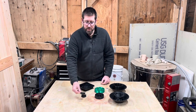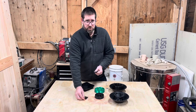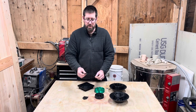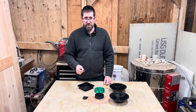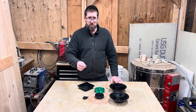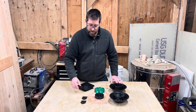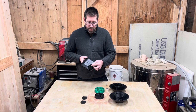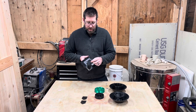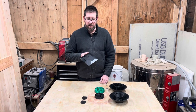So I moved on to the second iteration. I measured how short it was, added that to the overall length, changed the radius, and put a slightly bigger clip in. I printed it out and snapped it on — but this time it was too long, and the clips in the back weren't big enough to actually hold the lid on; it would flop out. With this one I was also able to take more measurements, and I came up with the third design. I increased the size of the tabs in the back to hold it on, got the right radius, and added this nice clip.